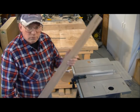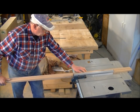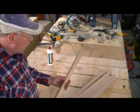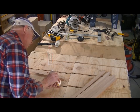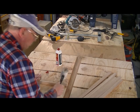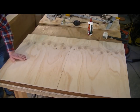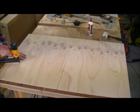I've just cut the Tasmanian oak into two so I can cut it up into runners. I've cut all my drawer runners now, and I'll be putting a bead of carpenter's glue into the dado and fitting these in. To hold them in place while the glue goes off, I'll be putting some one-inch pin nails in. I've drawn a very faint line on the back to mark the center of the runner, which gives me the exact location for where to put the pin nails.